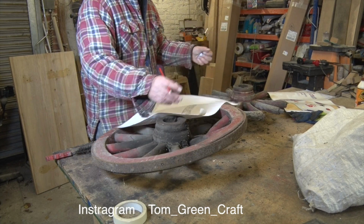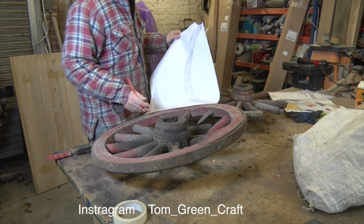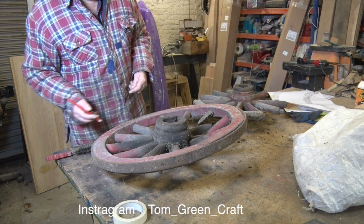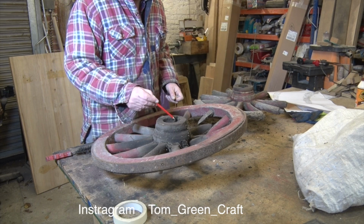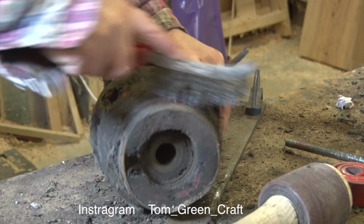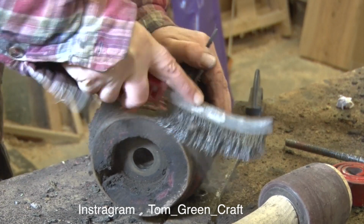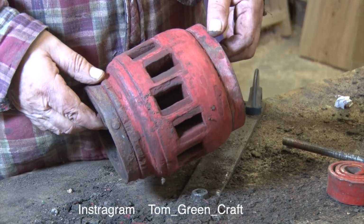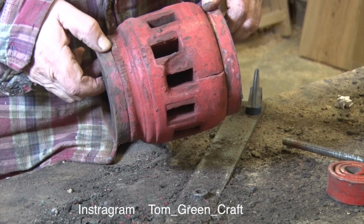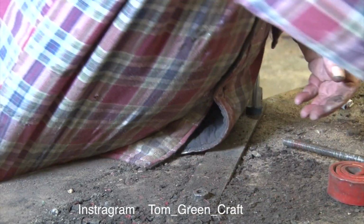Right, so I can now use that. That will give me the spacing, and the combination of that and that in good condition. I'll have the lettering and then we can redo it. So I'll now just completely disassemble these, take the spokes out, take the fellies off, see whether we can save the hub. Well, it looks pretty grim, but underneath it all it's all pretty solid. Well, here we are after sort of half hours fettling and doing stuff. You wouldn't think that was the same hub, would you? But that is pretty solid, so I don't think we need to worry about making another one.